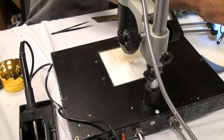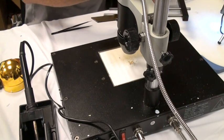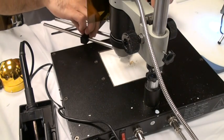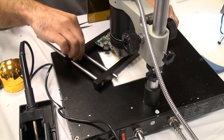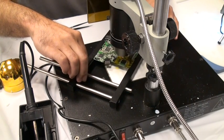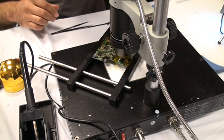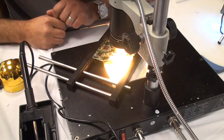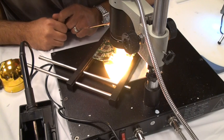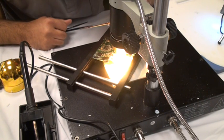After you heat it up, double check, and then we can suck them back down. Usually what I'm doing here — it'll actually turn from that cold-looking color to a shiny silver color, and as soon as you see that you know the legs are pulled together. I'll usually turn it off and just wait like 10 or 15 seconds. It's not yet — it's going to take at least a minute.